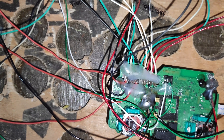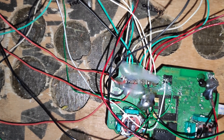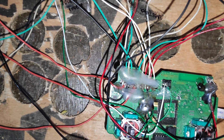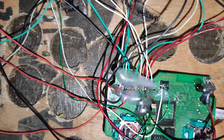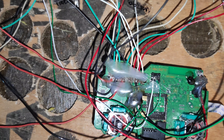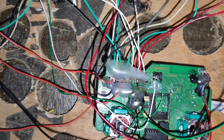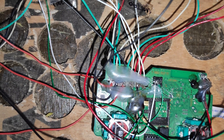One point to note while doing the soldering: make sure that you do not use cheap wiring. Cheap wiring takes a lot of time to solder on the track, and due to that there is a high chance the motherboard will get overheated. There is a high risk the track will come out before you can complete the soldering. Always use high quality wire — it will immediately attach to the track in no time. I have experienced that myself.